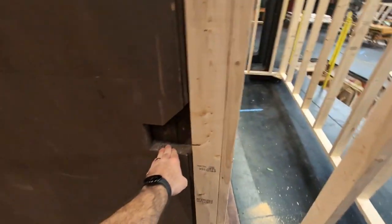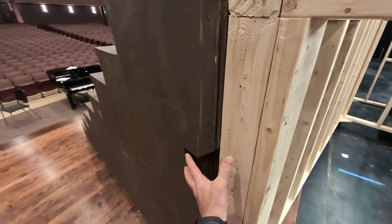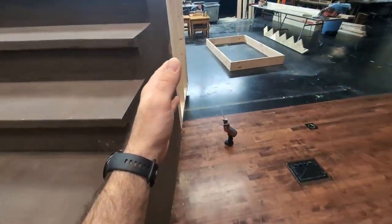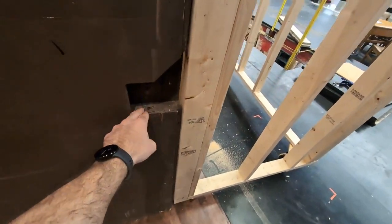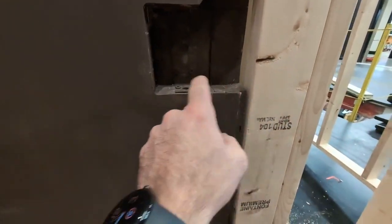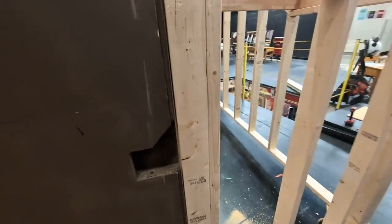And then this ended up being, because I had the lock on the outside for the longest time, and then I realized, well, this has to be a completely smooth surface for the aforementioned arrangement where they come together. There can't be a lock or anything sticking out. So I ended up having to recess that latch, and this is how I did it here. It was a bit of messing around that I did later and did carefully, and then put this Luan back on and followed it with the trim router so it had some really clean lines and stuff, best case scenario there.